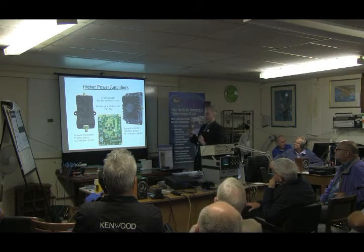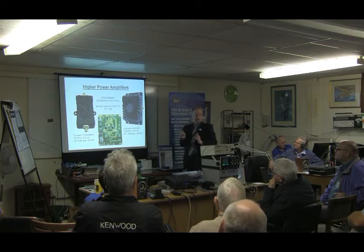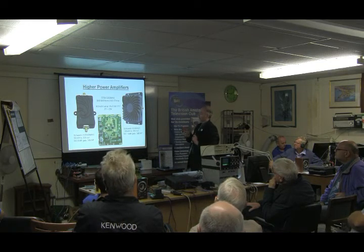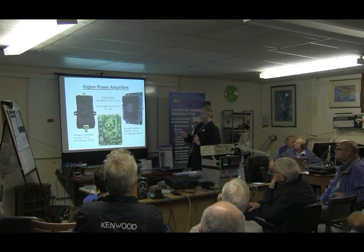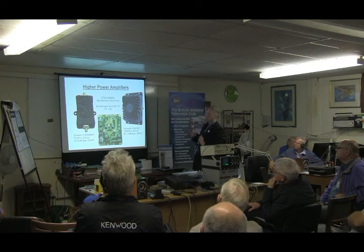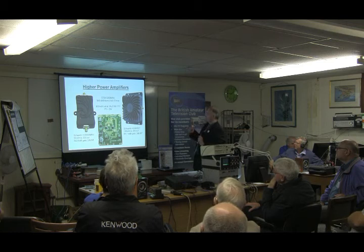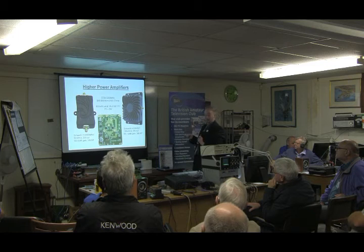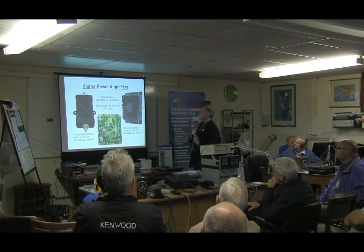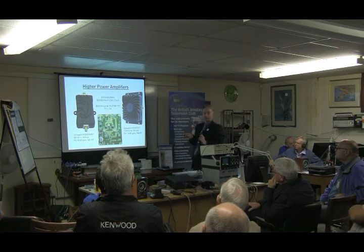3% EVM — EVM is sort of equivalent of MER — and Charles tells me that 3% is quite good. So that looks like the linear power we'd aim for. But they've brought the gain down on these to work with the FM modules, so these are really fine for the FM modules but don't really give us much for digital. Certainly not at the price anyway — we can do a lot better. You can actually buy the PCB, although it said they will not ship to the UK, so not sure what was going on there. Fine for FM, but not so much for digital.